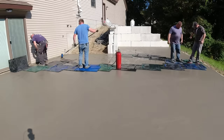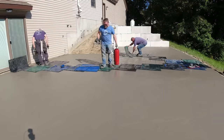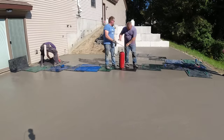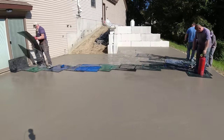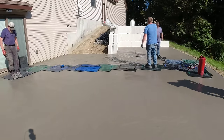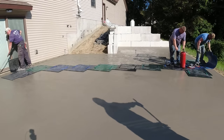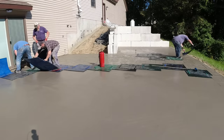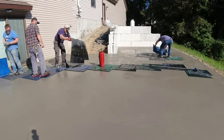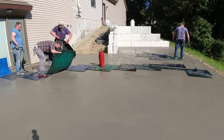We actually have to get under a deck too. The good thing about having some of the deck overhanging the concrete is it's providing a little shade right on the very end of the concrete that we'll finish up on, so that's going to help keep that a little bit softer. Now you can see Luke back there going back towards the retainer wall, and then Darren, Harvey, and Sean are working their way down the concrete this way. This is basically the pace - one stamp at a time, four guys being careful not to bump into each other or push each other off the stamp.